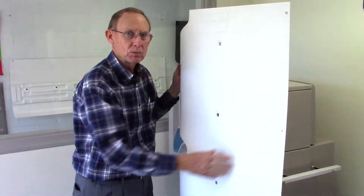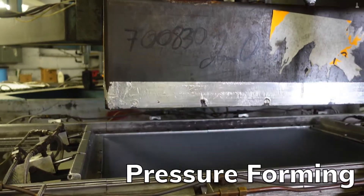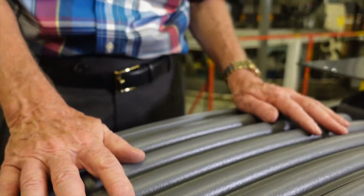This is a perfect replacement for fiberglass and we can prototype for you — we can build a production tool right in-house. Pressure forming is the science of adding 120 pounds of compressed air to force this smooth material into this tool to pick up this pressure and this texture. Any texture that you could use on an injection mold, you could have on this pressure form part.